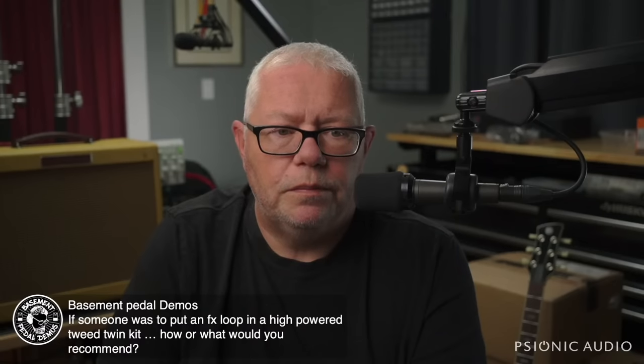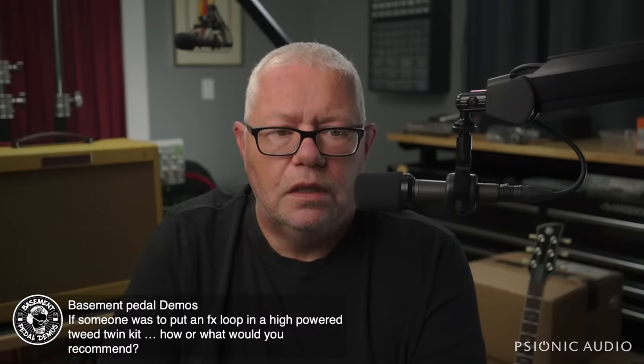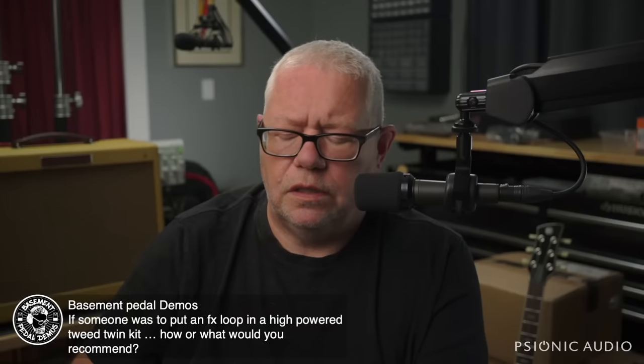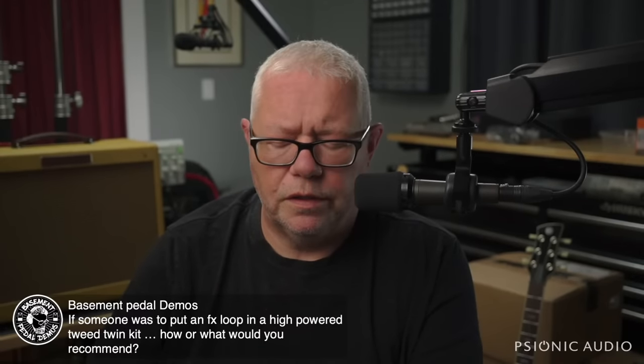Hey, basement pedal demos. I wouldn't put an FX loop in a Tweed Twin kit. The output section and the phase inverter are going to be pretty dirty in those, so you're not going to get much benefit from it.